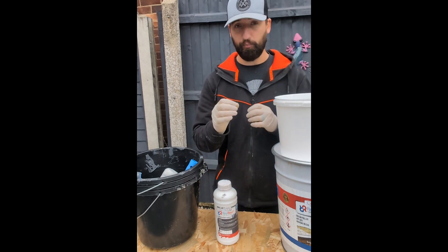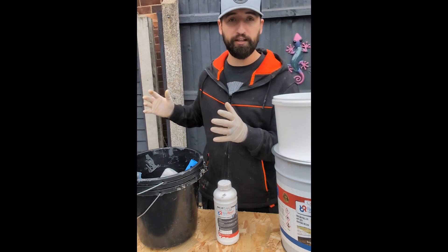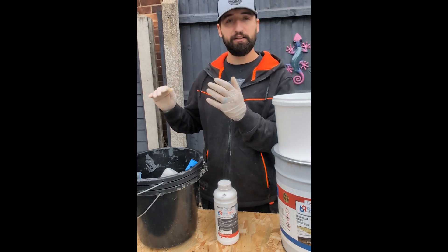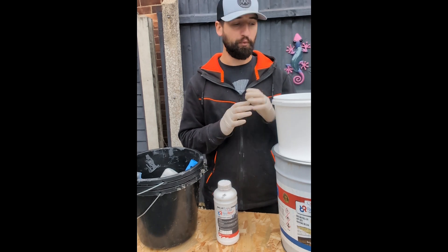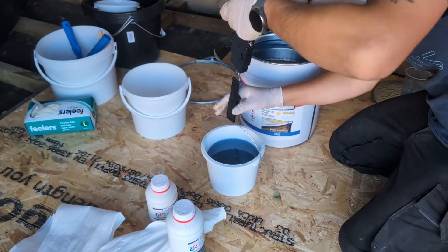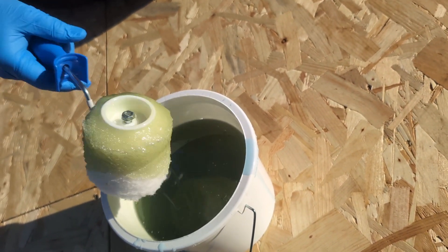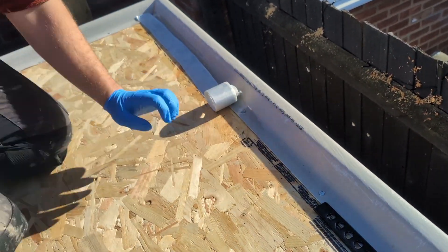To help with speed, you can split your five kilos of resin into multiple mixing buckets. I actually had two mixing buckets on the go at the same time on the roof, each with five kilos of resin and my catalyst ready. When I finished one bucket I could pour the catalyst straight into the next and mix up there without measuring any resin. My first mix was actually a two kilo mix, specifically for installing the bandages, mixing up on the roof to avoid wasting time. Dip the roller into the resin and apply it down onto the area where you're going to put the bandage.